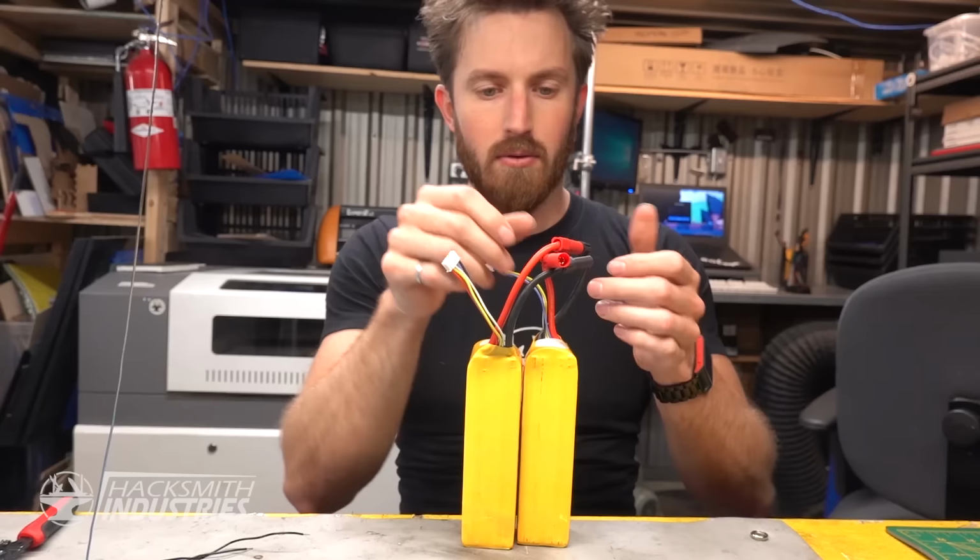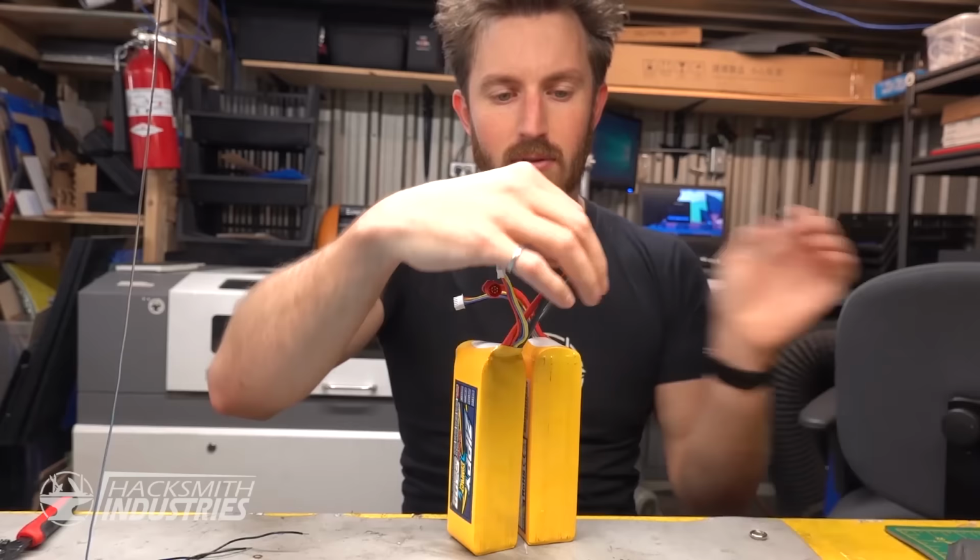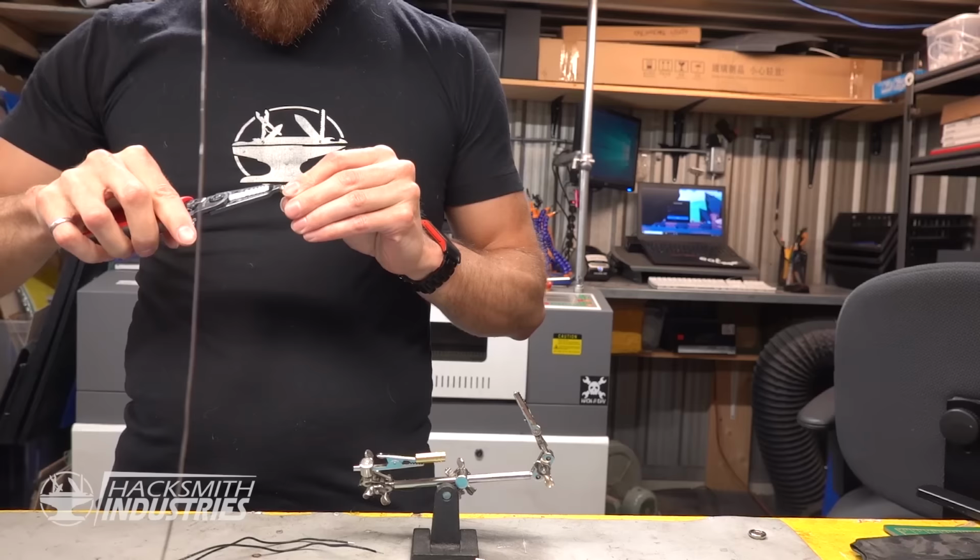So, for the LED, we're going to need about 30 volts, but for the persistence of vision, Dr. Strange's magic spell, we're going to need 12 volts. So we've actually got a tee off right here by making a tee connector.